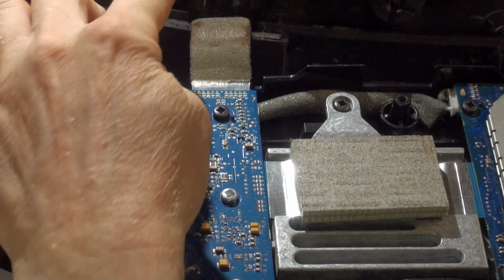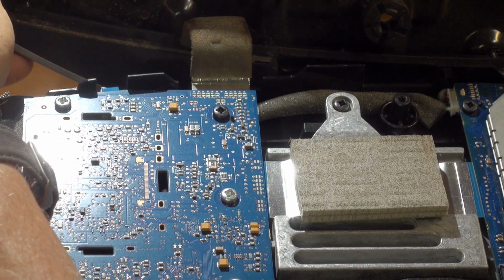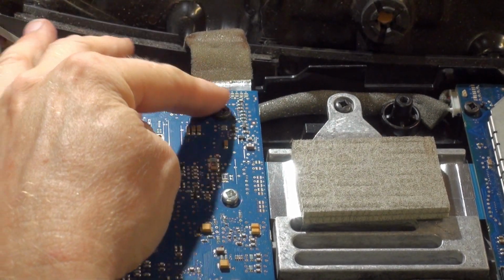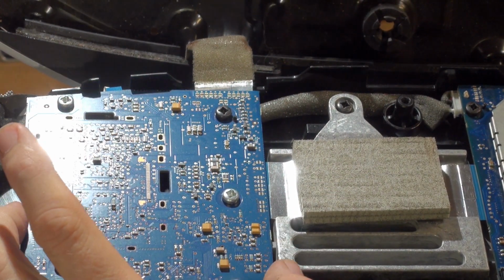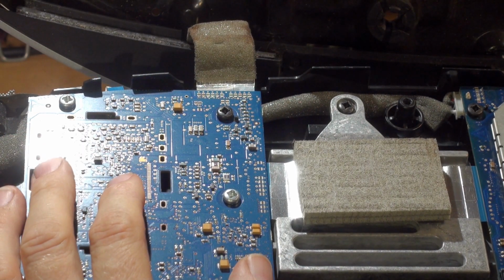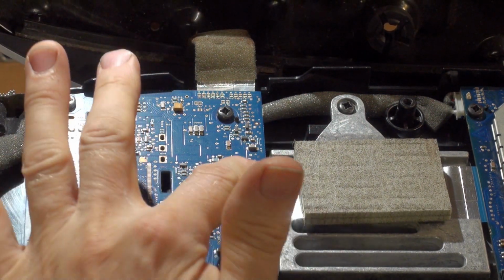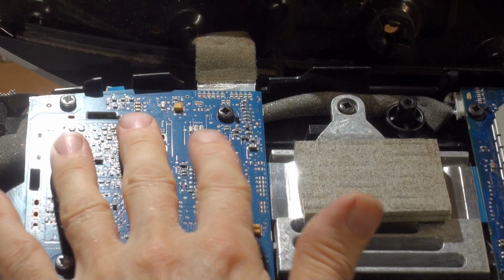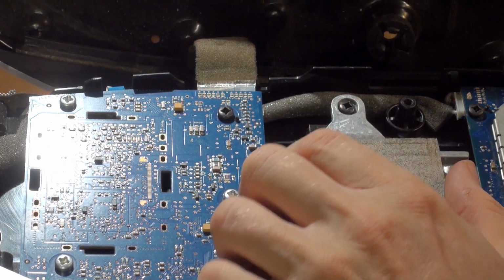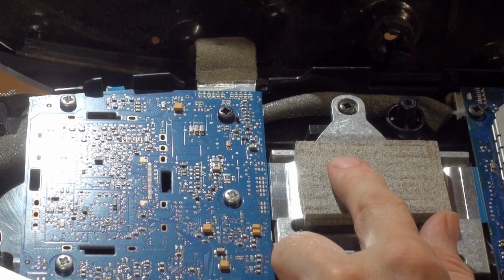So here we are. Yeah, this is the ribbon cable, and it's coming from the front section. I'm in trouble holding this here for you, but there we go. Hopefully you can see it clearly. There's the ribbon cable, and it plugs into this. This is the sound processor module for the SoundDock 10. So in there is the digital signal processing and all the remote control interfacing, and out of this come the signals for the amplifier. The power goes both ways, and the signals go along this ribbon cable in the middle. There's another cable. You see that thing there? That's a screened ribbon cable. Very hard to get hold of, so be careful.